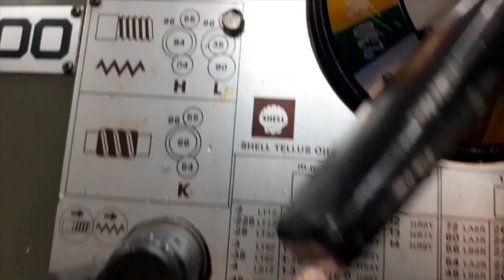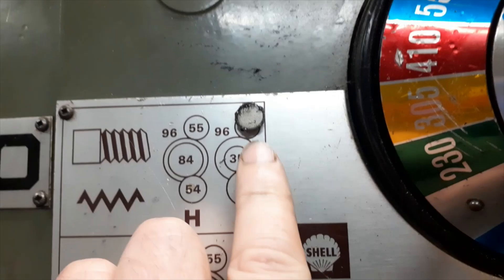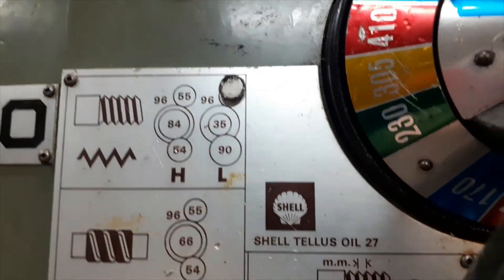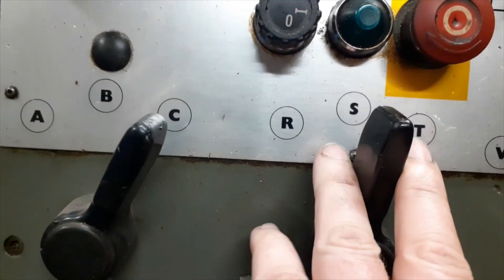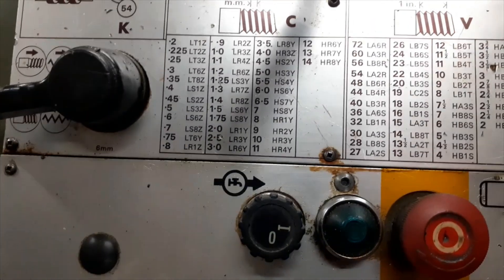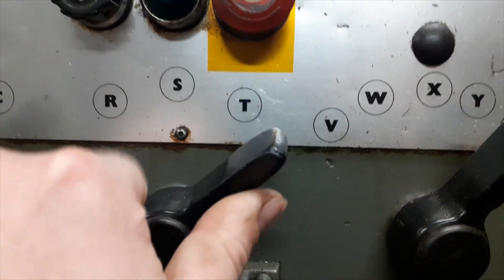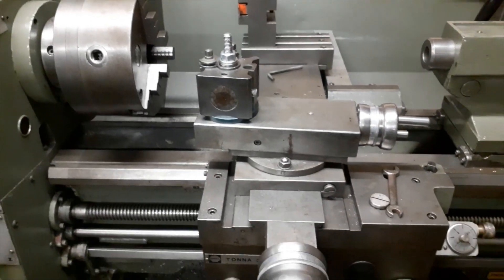So for instance, let's say I want to cut metric pitch 1.25. You want it on L — which is this gear train up here. I keep a little magnet and when I've set the gears at the back I'll put the magnet on there so I know I'm on L. Then if I change to H I know I'm on H — a nice little tip. So we wanted L, then S — I think this is already in S. And then three — yeah, I think we're already in three. Then Y — yes, it's set to Y. You just change it to whatever and that does your lead screw to cut your thread.